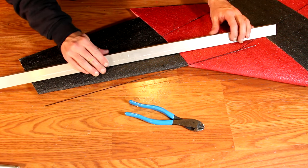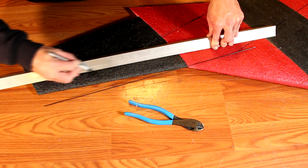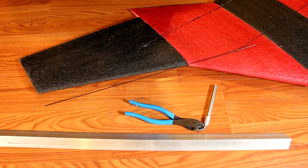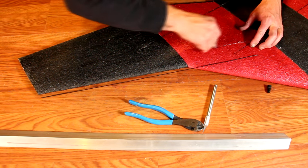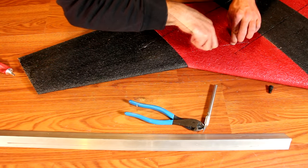This will keep the airplane from flapping its wing tips when pulling out of a dive with a lot of weight loaded up on it. The procedure is the same as the top: mark the ends of the spar, take a straight edge, cut your line, embed your glue, and then embed the spar into the slot.